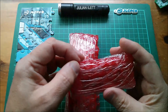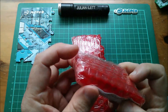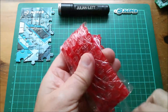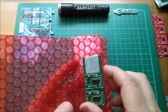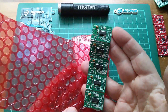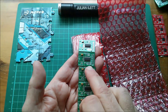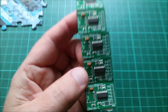These are the Chorizo USB-to-serial adapter and also my Pro Minty - the initial version of the Pro Minty - which is my microcontroller Arduino-style board. Let's see what this smaller package is. Here it is: five pieces of the Giuliano Chorizo C, so that's the version with the CH340C chip, which doesn't require a crystal and load capacitors because it's got a built-in oscillator. Let's take a closer look at one of these.